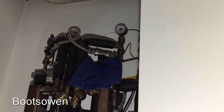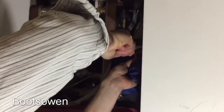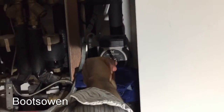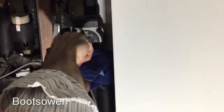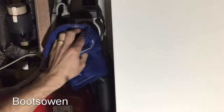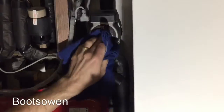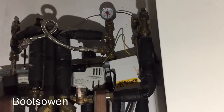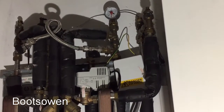Try it on one bar and see how it goes — it might not have to bleed it here; I might be able to bleed it through all the rads. So that's the circulating pump for the central heating, and that's me bleeding it just by unscrewing it, and that's gotten rid of the noise. Keep an eye on the pressure — it's just over one bar; that should come up maybe a little bit, and then the rads should begin to get hot now.